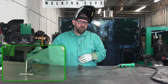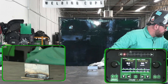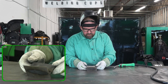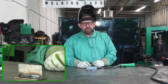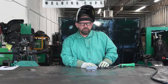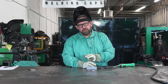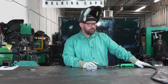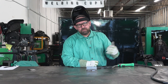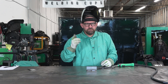My push was a little off on my angle but super clean run — no spatter. We've got our inductance set right at 60, which is actually where power set calls for it. Nice clean run, smooth, no spatter. So if you're looking for a roll-around shop MIG with single-pulse capabilities for spray mild steel, stainless MIG, or aluminum MIG — and this thing is spool and push-pull gun ready — check out the 313 Pi. We'll see you guys next week.